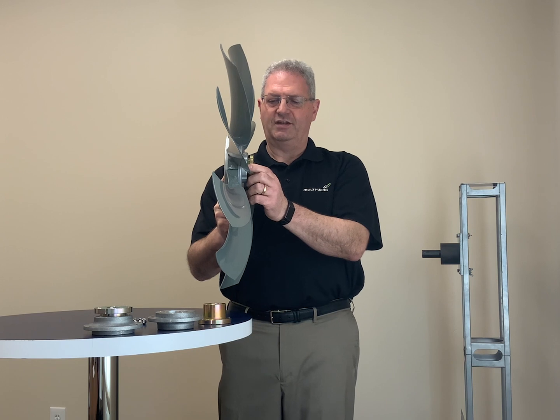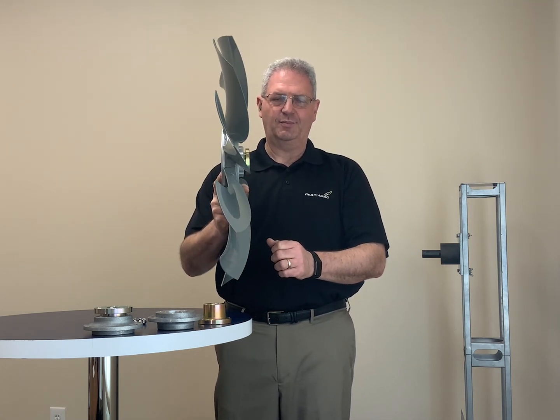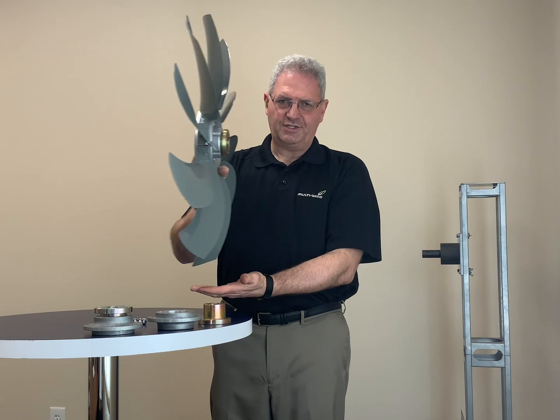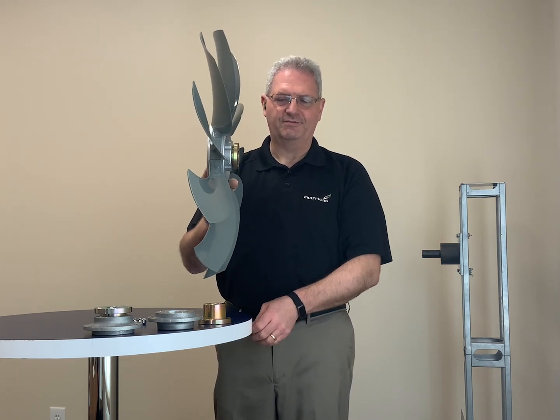The different options I'm going to present will allow you to change the axial position of the fan in your application — either to move the fan farther away from an obstruction to avoid a blade strike, or to position the fan appropriately in the center of the venturi to give you the most efficient airflow.